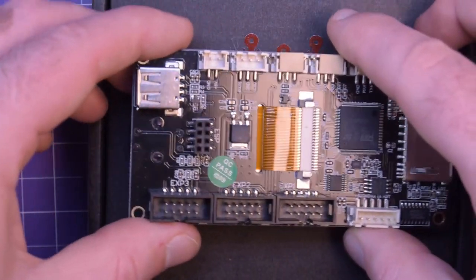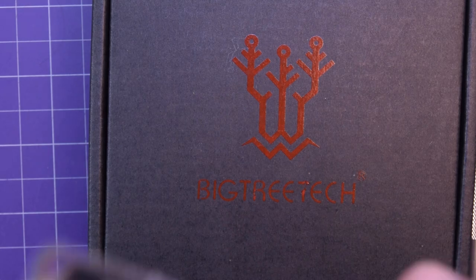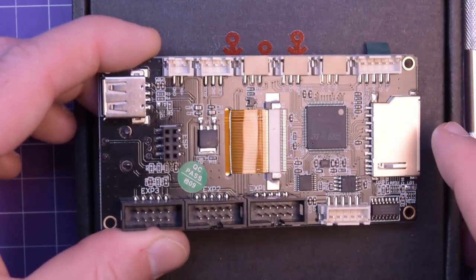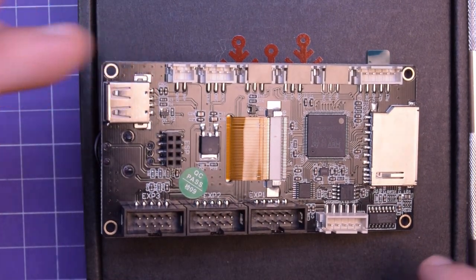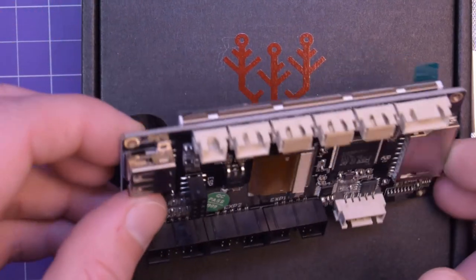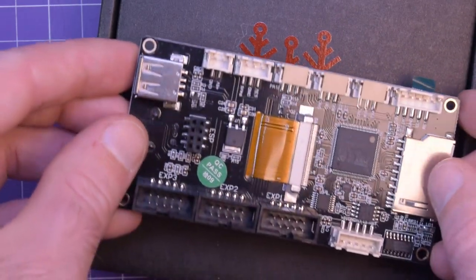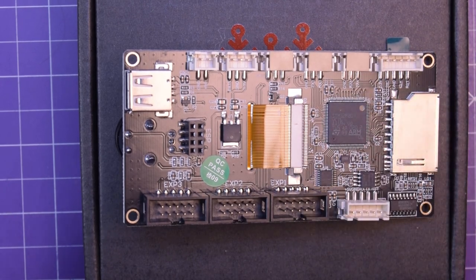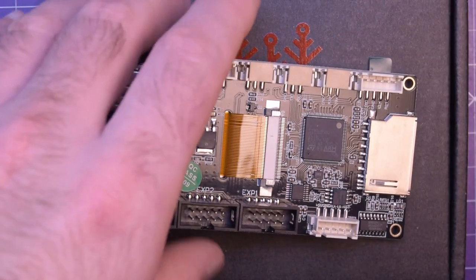On the backhand side there is an STM32F207 — a 32-bit processor simply for the touch interface. It's got expansion slots, room for your ESP Wi-Fi, USB, and a full size SD card slot. There's a whole bunch of space for expansion here and other modules to put on, especially because it's an STM32. This is more processing power than I use in my regular projects, and that's just for this board — this board handles its own processing.